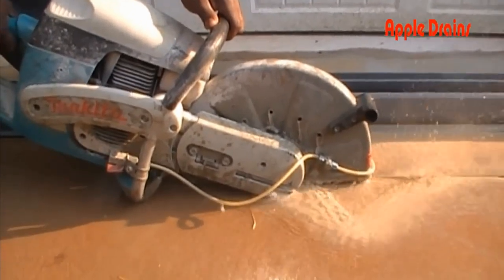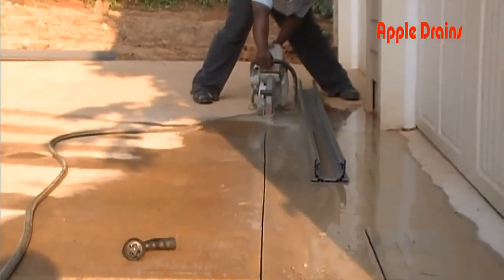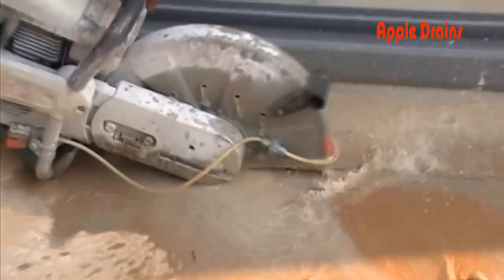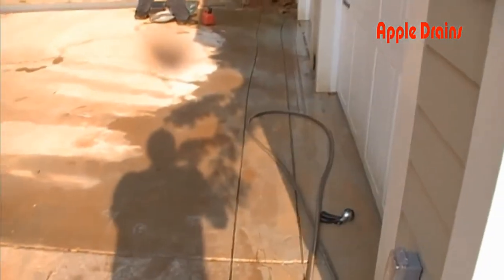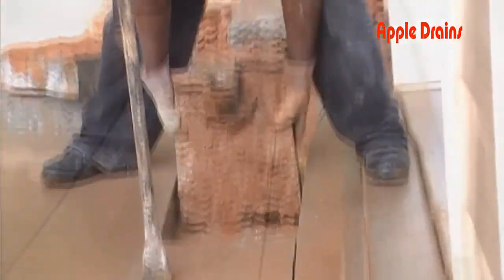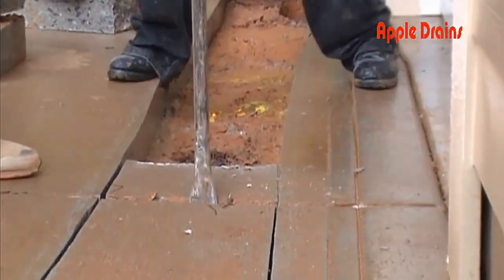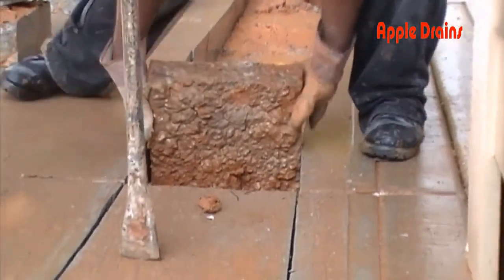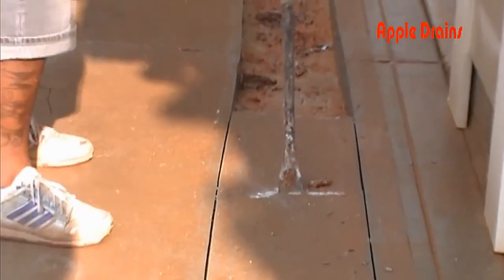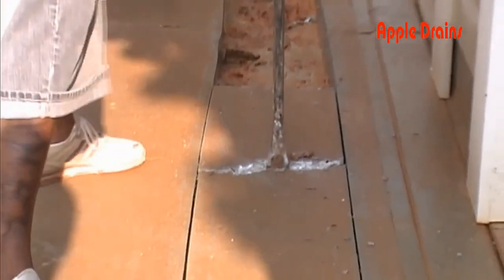The first thing we're going to do is start cutting some concrete. We're using a partner saw which has a 14-inch blade, and you'll notice my foreman Eddie is making the cuts down through the concrete, through the driveway. This takes a little while. The secret is that you need to cut all the way through the concrete — it's really important. Make sure you add water to keep that saw blade nice and cool. To remove the concrete is actually the simplest thing to do, especially if you have cut all the way through. Concrete will weaken and crack with just a few hits, and you can see how quickly this pry bar lifts out the concrete. The secret to breaking the concrete is to continue to hit it until it cracks — the more you hit it, the weaker it will become. If you have cut all the way through the first time, this is a very simple job.